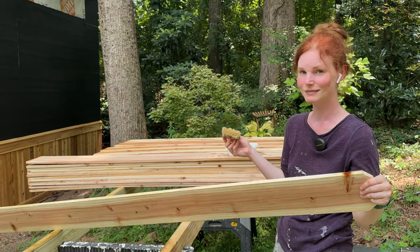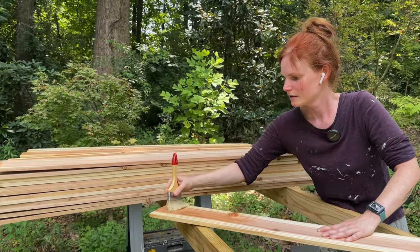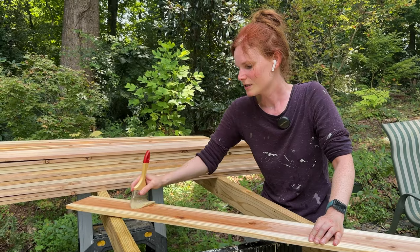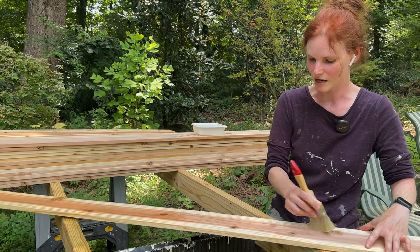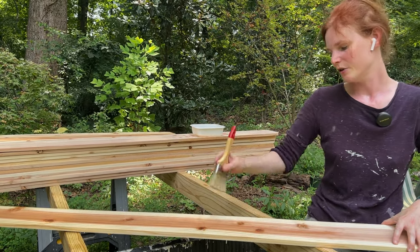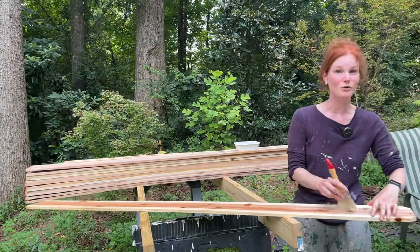So that's about 20 boards for this little roof. I just don't handle the heat very well, honestly. I'm trying to push the oil in rather than slathering it on, because if it's too thick it'll never dry and will be sticky. So I'm being very ginger with it and just pushing it in — hopefully that's a nice thin coat. I think I'm going to do just the one coat because it's so hot. I'm just going to push through it, or I'll run out of oil — we'll see what happens first.